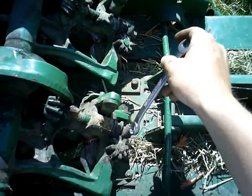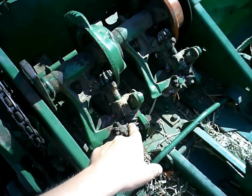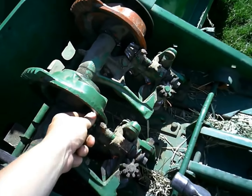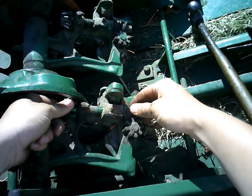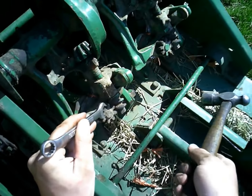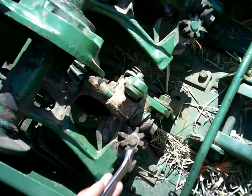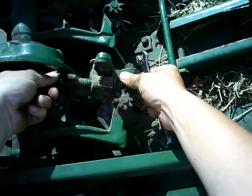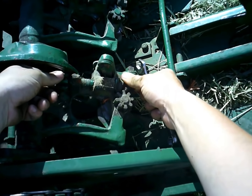To move this twine disc you've got to loosen this thing up. This worm gear is on a tapered shaft, which runs up to here — and this thing was also loose. I mean, I could really turn it. It's tight today and I've reshimmed it. I get that loosened up, and I'm just going to tap that thing over a little bit so that it's overlapping just a little bit there. It depends on where you set this worm gear because you can see that would change the timing quite a bit too.